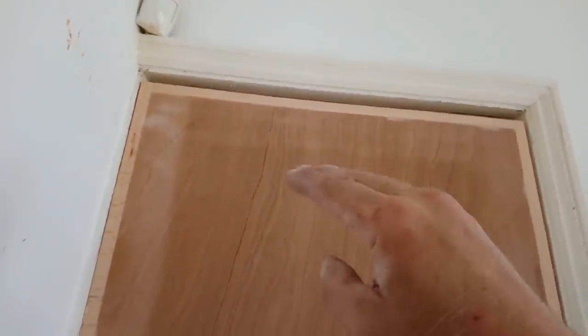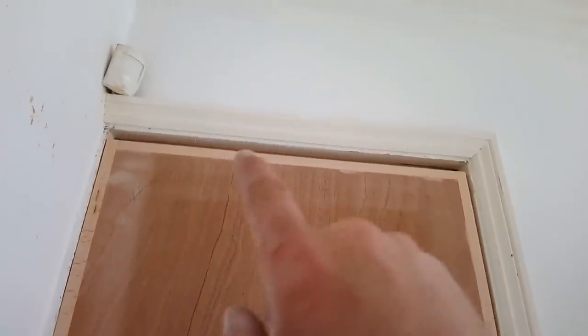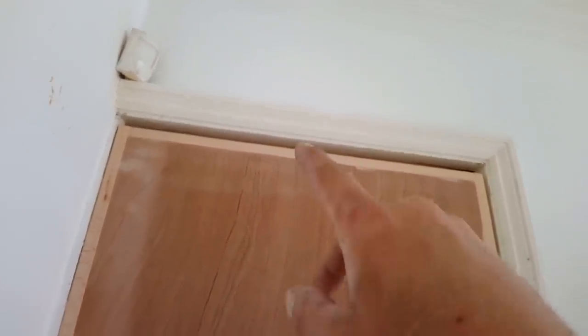Make sure it's somewhat parallel. I'll take a bit more off these bottoms to make them fit. But I'll work from the hinge side. Nothing at the top. From about there down, I need to take off 2 or 3mm. Can weigh a ton these doors. Right. Got chisel just wedged in there. That gap's pretty much parallel at the top, so it'll be able to go up. But I don't want it to go up too much. Like I say, I always knew it was going to be a gap, so I'm just going to put a 20mm piece on the frame and another piece inside to create the rebate.